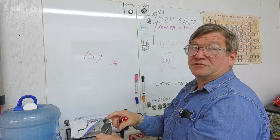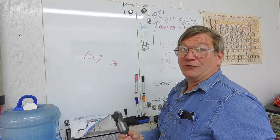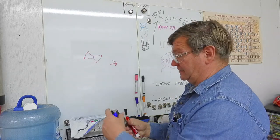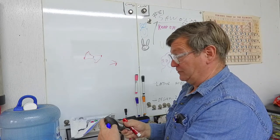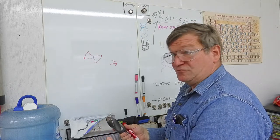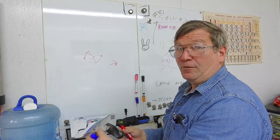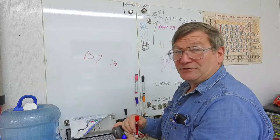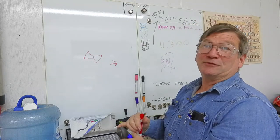The dead center is just a chisel in its native form - the way a lot of people sharpen bits it will just smush the metal as it comes around rather than cutting. That middle portion takes a lot of pressure on a big drill bit. What you usually do is pre-drill the center - drill a pilot hole. When first learning machine work, I was told your pilot drill should be half the size of your drill bit, but that's not really a good rule.